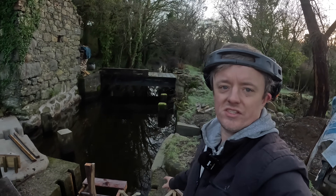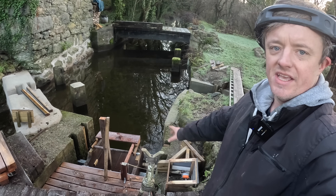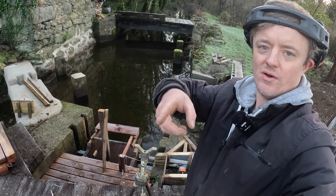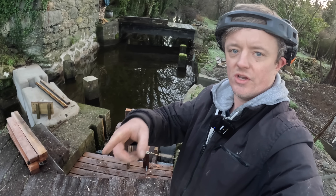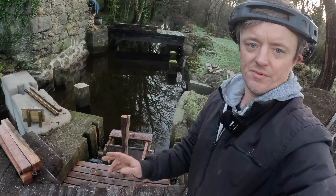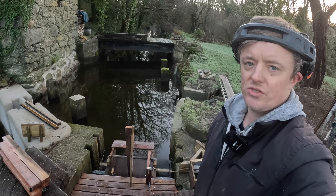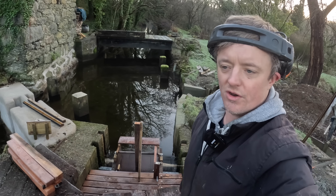There are scenarios in which that could fail — if there was a really hard frost and it all gets stuck. But if that doesn't actuate, we still go on to the electronic dump load. And if the electronic dump load goes wrong, we've still got that. For both of them to go wrong at once would be very unlikely. So we've got a fail-safe with redundancies — two safety features — which should mean the wheel can never over-speed.